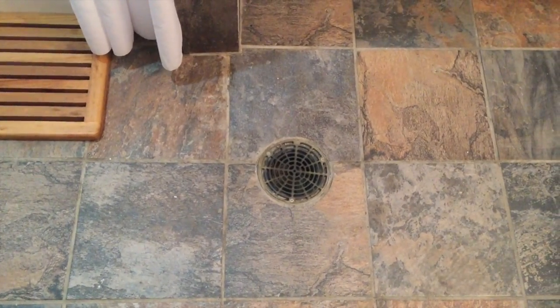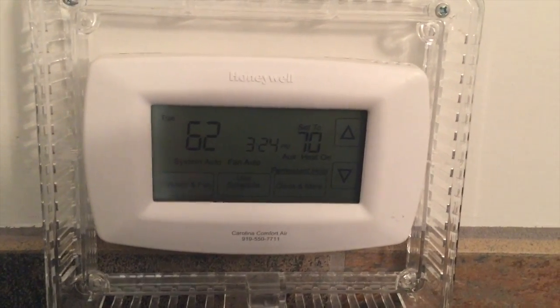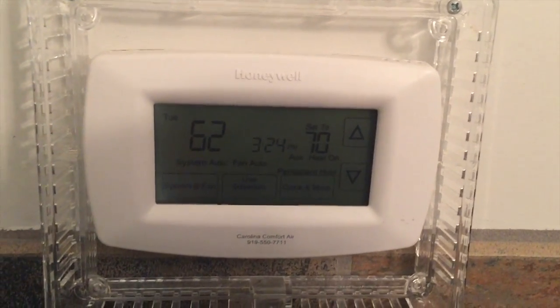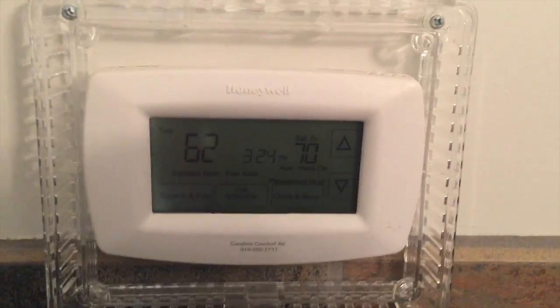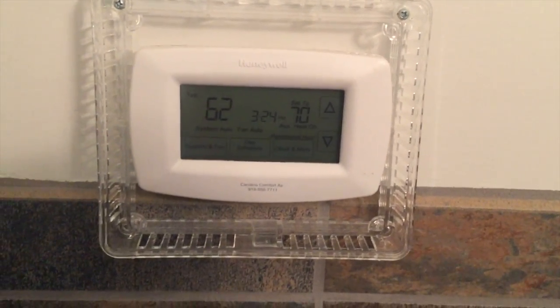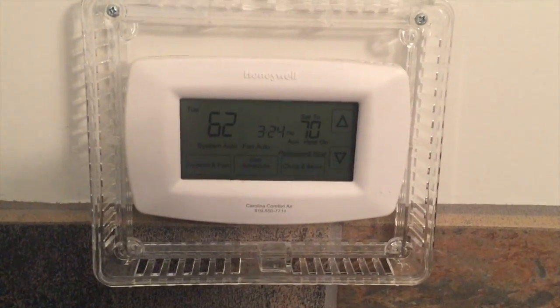So I'm at this resort, the Valley Oaks, and they've got one system on a bathroom laundry complex, and the system is displaying auxiliary heat on, but the room temperature is 62 degrees. I've already looked at the air handler and there's no power to the zone board itself.